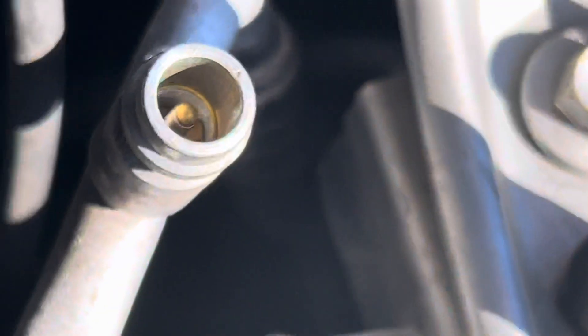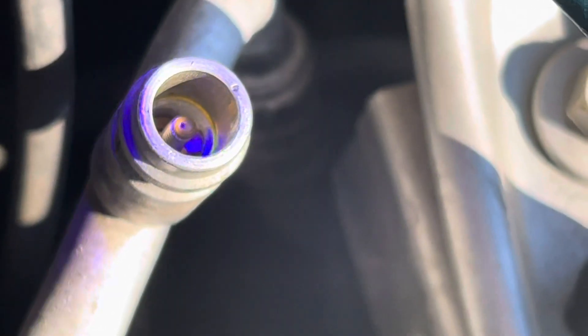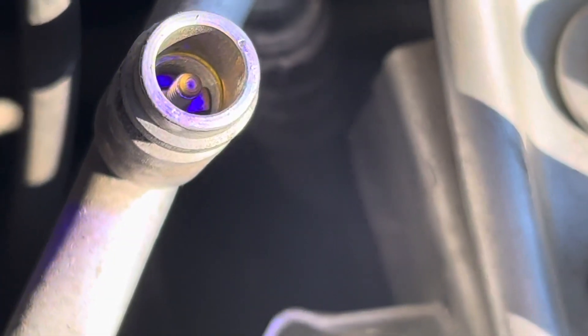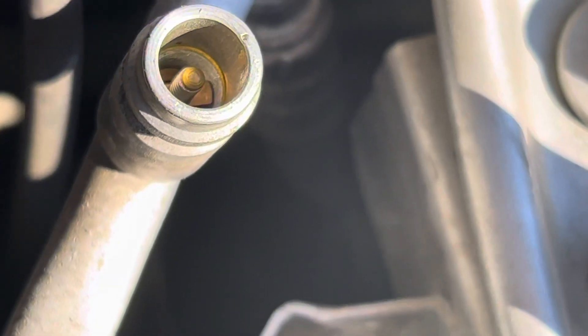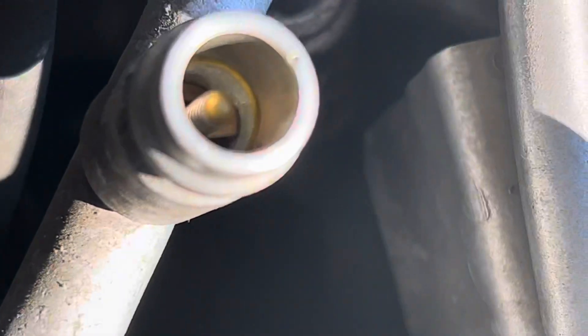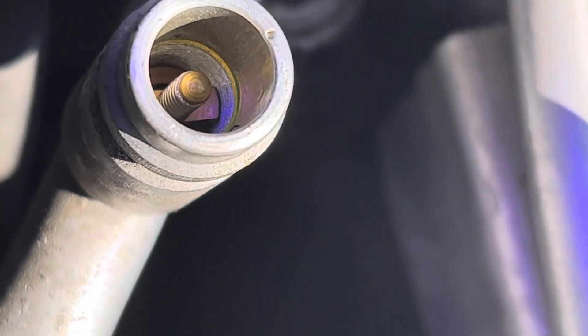Tracer Products. Let me click it on and let's focus back here again. You see the dye glow a little bit, just a little bit — you could barely see it. You see more of the purple than you actually do dye. So that was that one. Now let's use this one — this is 400 nanometer. You could see some of the purple light, but really you don't see the light glow. And that's from this one.